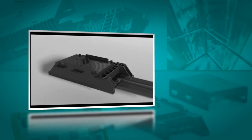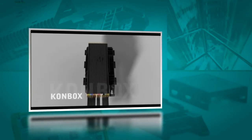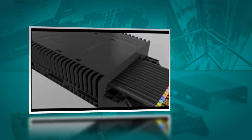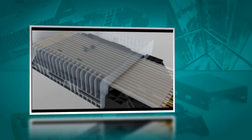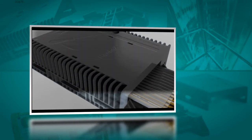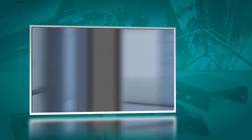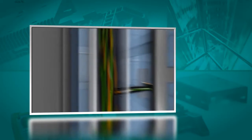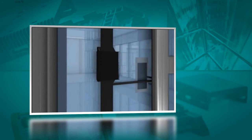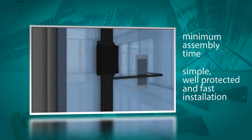Our pre-assembled electrical installation uses the CON-box system, which greatly reduces the assembly time, guarantees the quality of the CAN bus signals, and sets us apart from our competitors. The flat cable is manufactured with highly resistant and durable materials, which guarantee an optimal protection of the low-frequency CAN bus signals. An absolute positioning system of the car by means of a 4096 pulse encoder is optional. This makes assembly easier and guarantees millimetric precision of each stop.